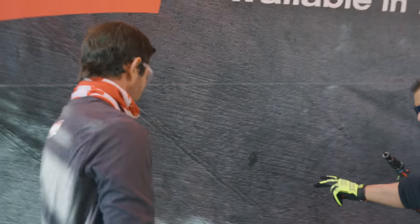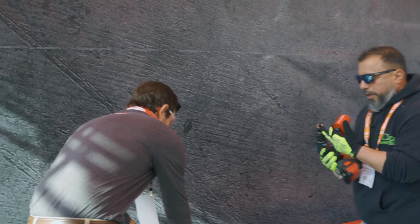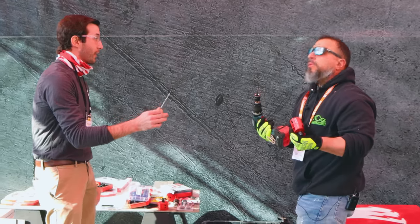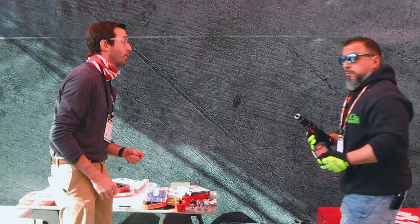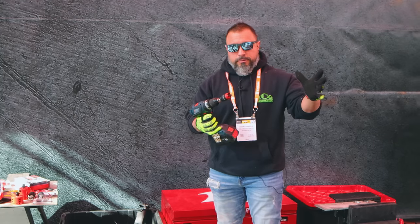What if we were going to use a different style of hole saw, even though they're interchangeable? Will we change our pilot point? You can change your pilot bit. So if you're drilling in wood, you're just going to use the standard HSS pilot bit. If you're going through a diamond grit, you'd be drilling in at a 45, but we also have pilot bits for those as well. It's as simple as pop it in, done.